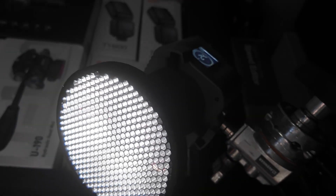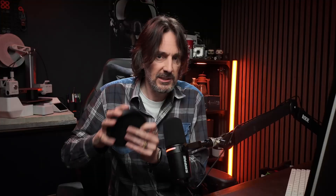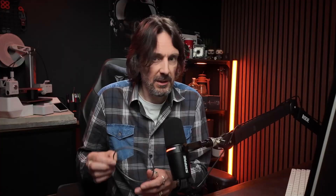Here's another example — this is the grid for the video light just up there. It narrows the beam down, but it has to fit onto the reflector that comes with the light. This inner ring has to be exactly right — you want it to click on and stay there. Rather than printing the whole thing repeatedly, I just printed this thin ring. It's only about a millimeter thick, so only a gram or two of filament. The first two tries were slightly off, not snug enough, but the third time I got it right. That's six grams wasted rather than a few hundred.